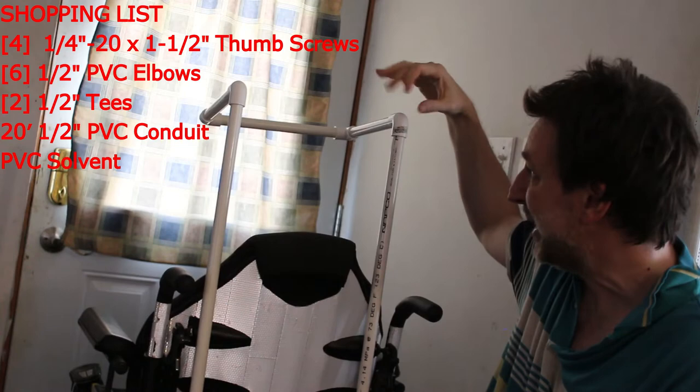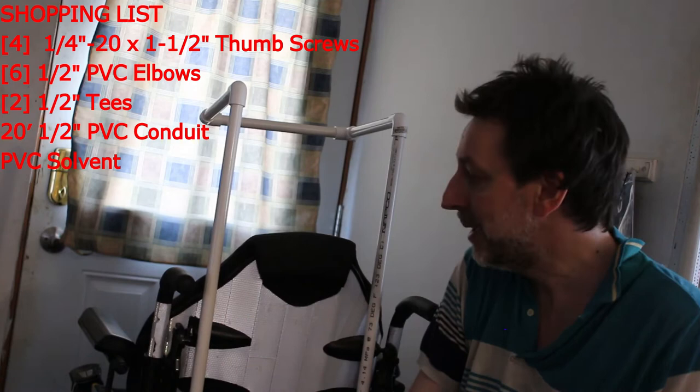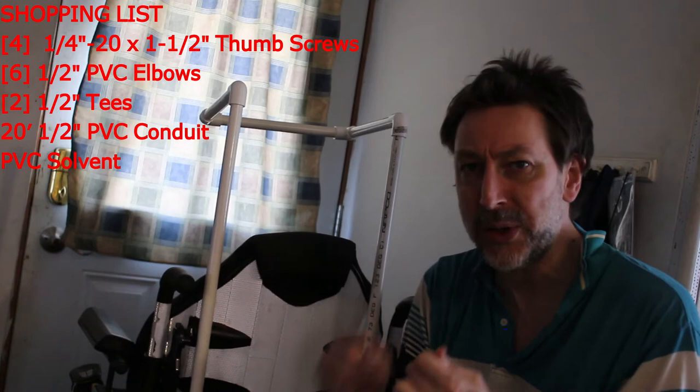Listen carefully to what I've got to say, and I'll put a paper diagram up after I point out where the various parts go. What you're going to use are six elbows — this is an elbow right here, same as your elbow on the body, meant for a 90-degree corner in plumbing. You'll need 20 feet, so two pieces of half-inch conduit, and you'll need two T's. The pair of T's go up here, over, and back in on the other side to give stability to the frame. Without that cross member it's going to be flopping around; it really does need that cross member.